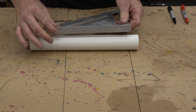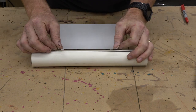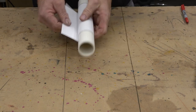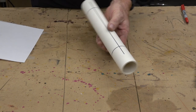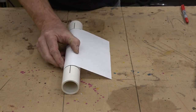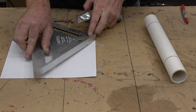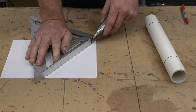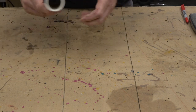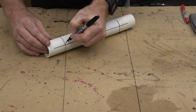Now that we have those two methods, we can use them to draw the starting points for the spiral. First, we draw a parallel line, and then we'll use a piece of paper to draw two perpendicular lines. I'm just using a Sharpie — it's not very accurate, but you can see it on camera a little better. So now we have the two perpendicular lines and the one parallel line. We're going to wrap that tube around once, mark where that line starts, and that's going to create a relationship that's one circumference around that pipe. We're going to go from that one full turn to zero, which creates a triangle that spirals around the pipe once in the length of the two perpendicular lines. Now we just draw along the edge of that triangle to get our spiral.